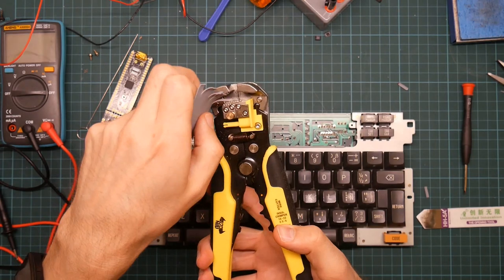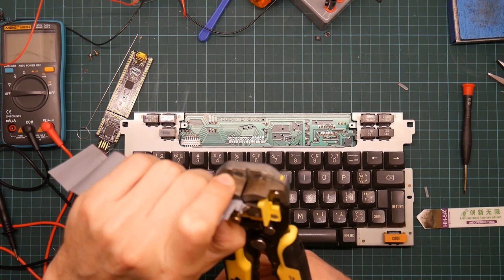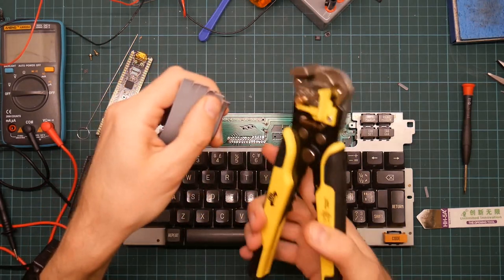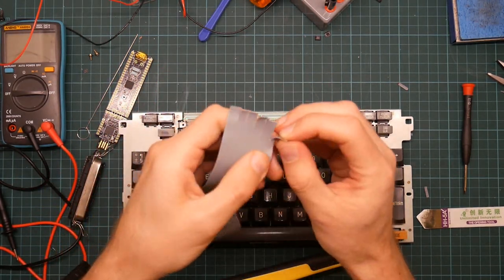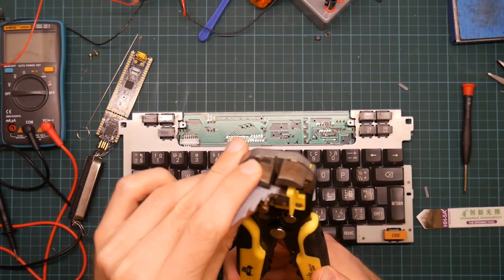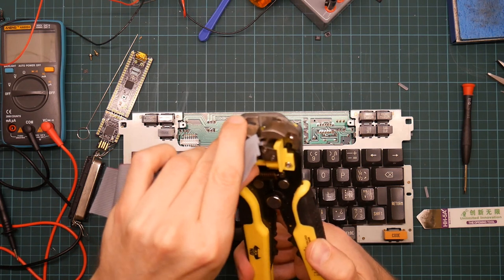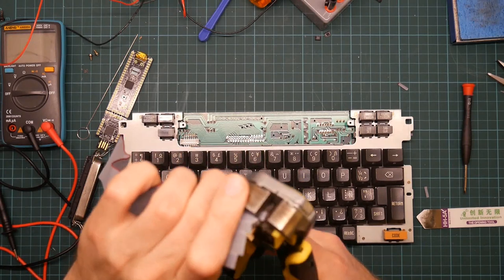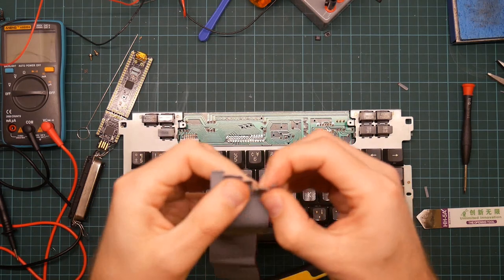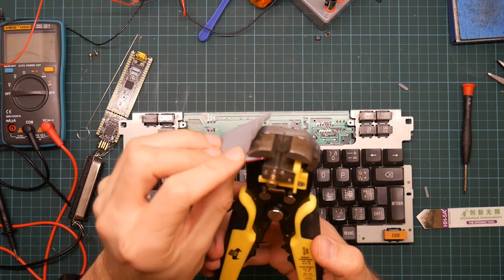Okay. I'm looking for about 3 to 4 millimeters of bare wire. Possibly a little bit more than that. The other end of this wire is going to be worse. I'll show you why when I get there. Come on. This wire stripper is great when it works,